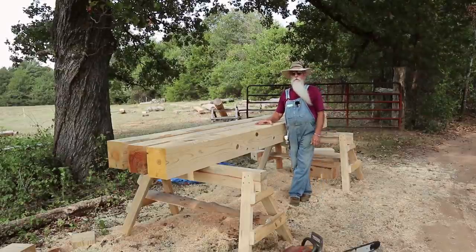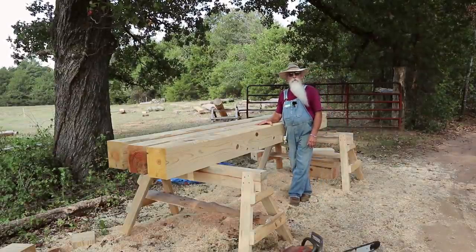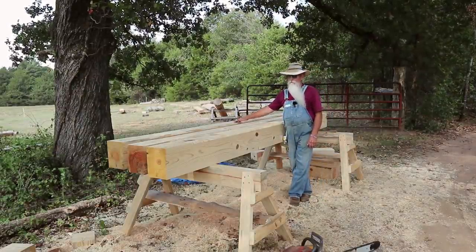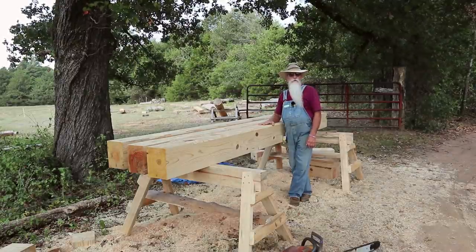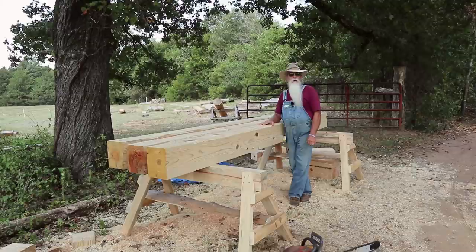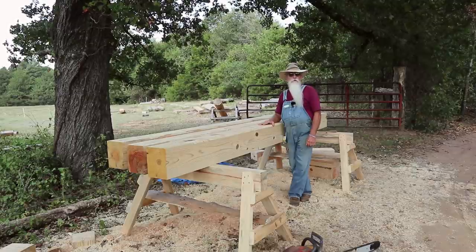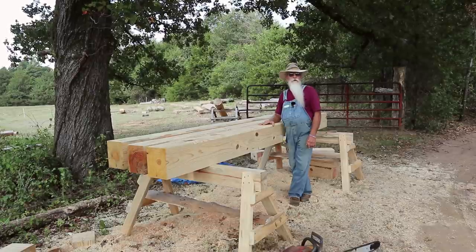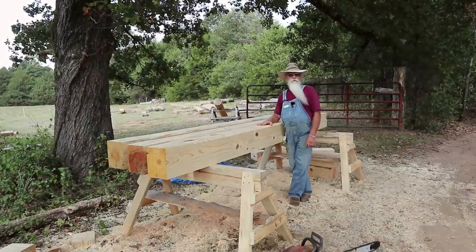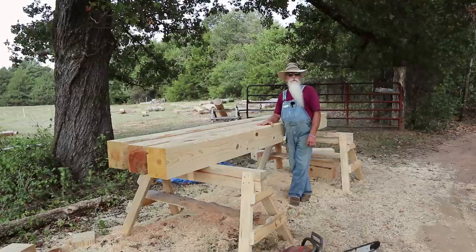I've been working out the second floor joist for the cabin down at Paradise Point. I've got three of them worked out here. I've got one left, and I'll have these ready to go. And round eight, as I've said, will cap over the A and C wall, and it will have the pockets cut to accommodate the second floor joist. So I'll turn you around here and I'll finish the last one up.